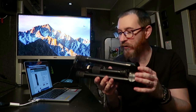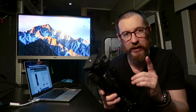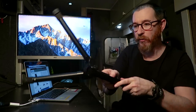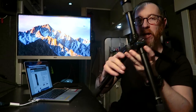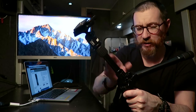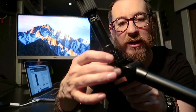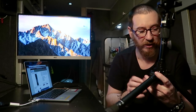Let's talk about the folding and the legs because they do some really clever things. They weren't the most intuitive to work out from scratch but once you do it's pretty cool. The usual sort of thing — they fold back on themselves, and to unfold they go outwards. Then right in here there's a spring-loaded mechanism. It's nicely made — feels very solid and machined out of aluminium. You lift it up, it's spring-loaded, and you flip it round. There's a little spot and a line, and when it's lined up that means it's in a mode where you can adjust the legs.